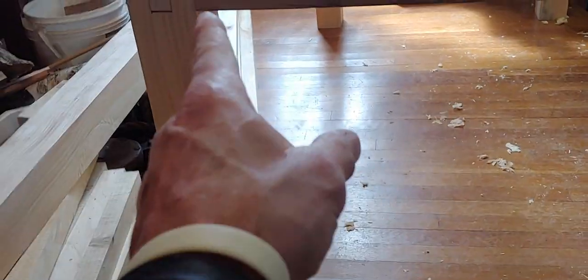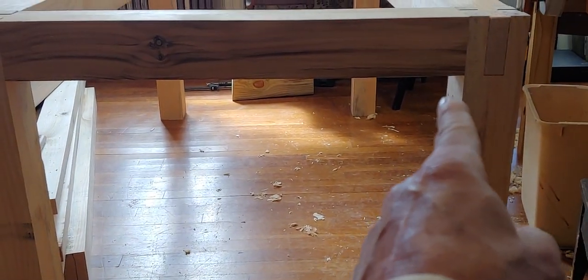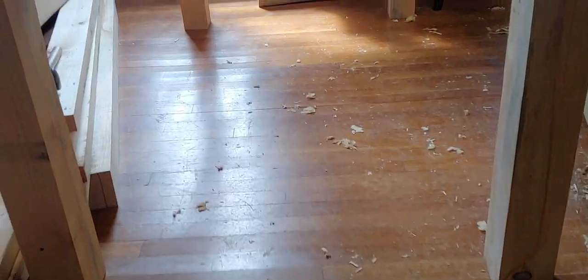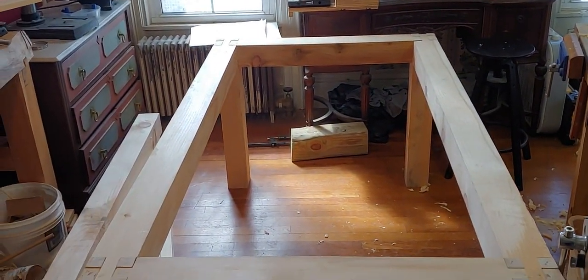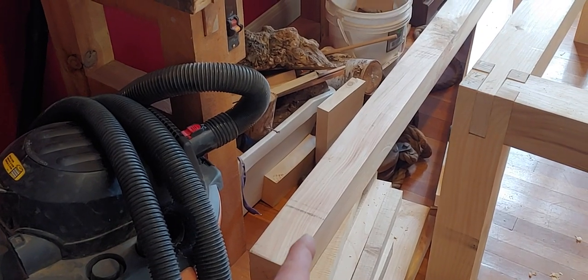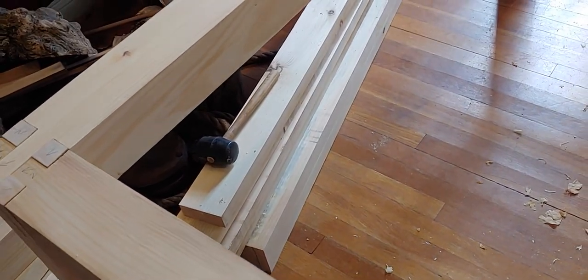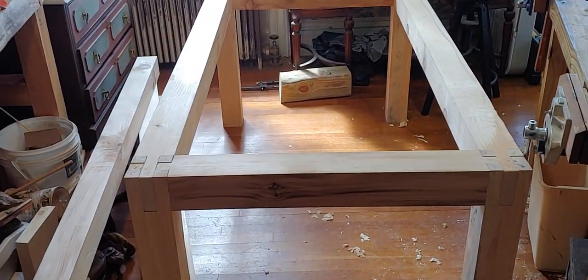This is going to get crosses - there are smaller boards I milled down. This was all milled out of the customer's lumber. There'll be crosses going this way and then a stretcher with a through-tenon that's wedged on the end - a cross here, same thing down there. Then there's a big granite tabletop going on top. Hopefully those of you that hung on to the end - that's the stretcher that goes the full length with the through-tenons, and those are all the components to make the crosses, plus an extra one in case I screwed one up. So that's it - from tree to table base. Hope you're having a great day.